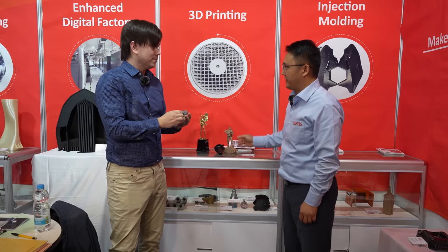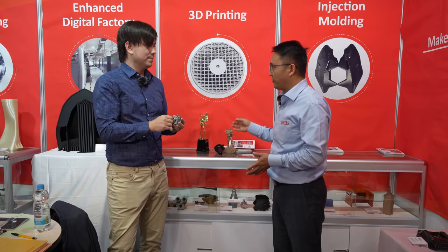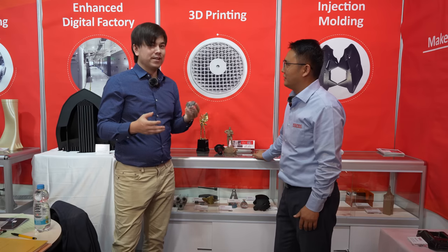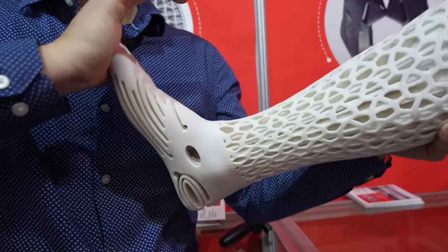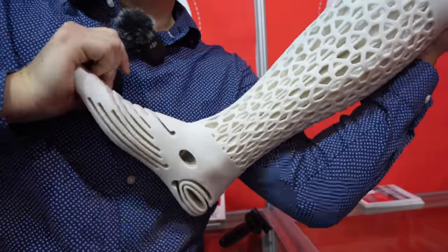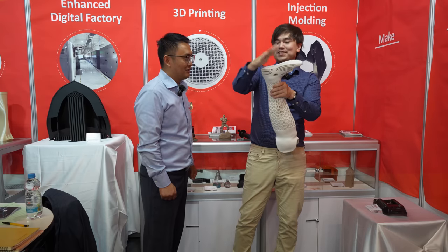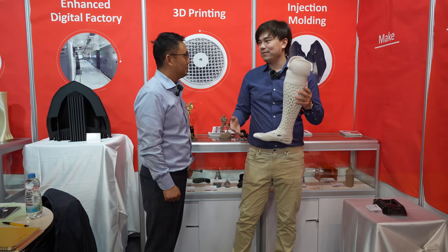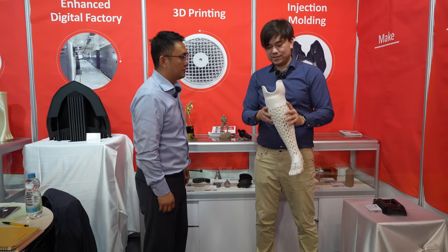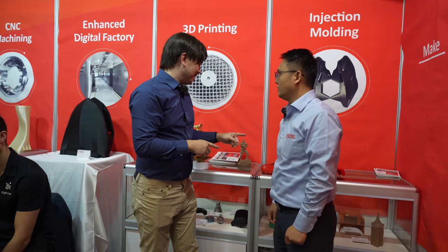This material is titanium — it's a very high performance material with lightweight and also high strength. Many industrial customers use this material for automotive and also medical applications for implants. Titanium is very non-bioreactive. Certain other metals like nickel can cause a rash or some kind of reaction. This one is a foot — it looks like it's got some progressive spring elements built into there, so it's kind of like an interesting prosthetic. 3D printing is really good for this kind of stuff. It'll have a bouncy heel and the toe will spring off. Stuff like this is kind of pushing the development of more advanced prosthetics. You can take the scan data from a patient's individual anatomy so it's just for them.